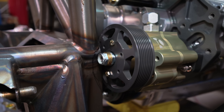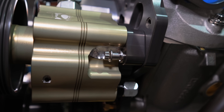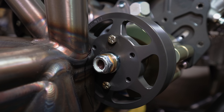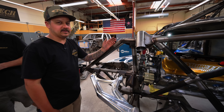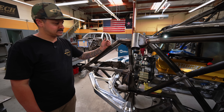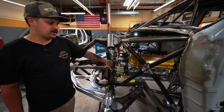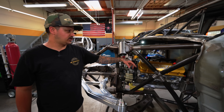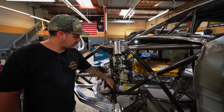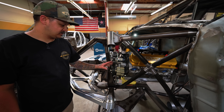As you can see right here, it does not fit — so you saw me earlier machining to get this in here. With the spacing off of here, this actually hits. The original plan for this thing was an LS build, like a big nasty LS, but we decided to go big block instead. Obviously big block's a little bit bigger than an LS, so we're pretty tight up here on space. Rather than cut the middle of the truck out and push everything back, we're probably just going to notch the bulkhead right here and plate it all back in so this clears.